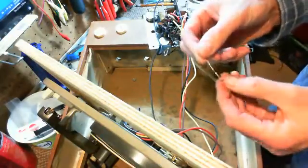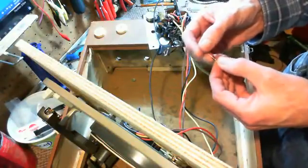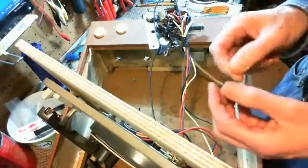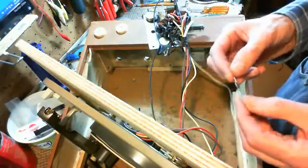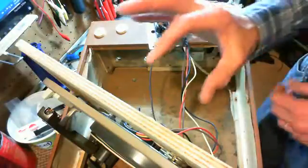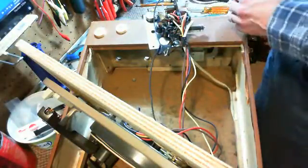So I've got this diode. This is a 1N4007, and despite its small size, it can carry an amp and the reverse voltage is very high, about a thousand volts or something like that. So that's a perfectly suitable little tiny diode to change that in there.